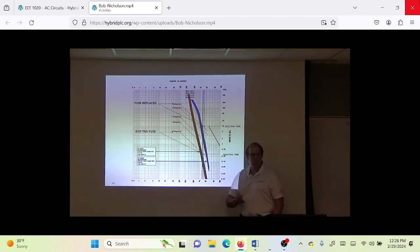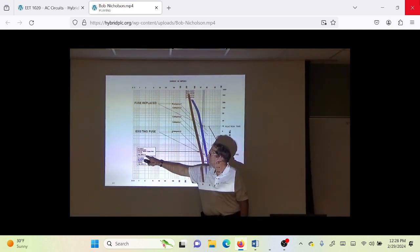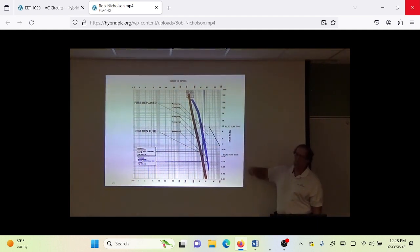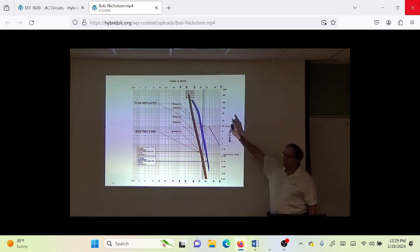That's category zero, which is a real low energy under that amount of current. Now, if you come along and put in a 200 amp Bussmann fuse, they're both 200 amps and they're both Bussmann. One's a KTSR, one's an FRSR. They react differently. Watch how this one reacts. 10 seconds. They look identical. But the amount of time that it takes for the inside of that fuse to react to that fault current is dramatically different. So now it goes from 10 seconds, which is 40 calories, which will probably kill you, by changing that one fuse. Downstream, you've changed time.